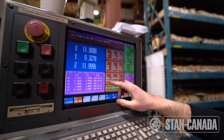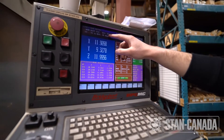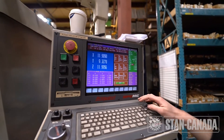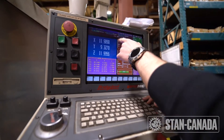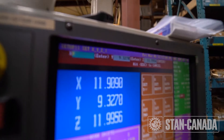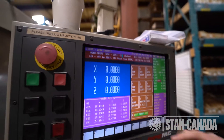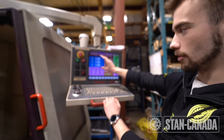So 1 is your work shift value — you can click that and toggle between G54 and G59. Hit enter and then put your values in. For example, entering 0 for each axis changes your position. Now this is your work shift value for whatever program you're running.